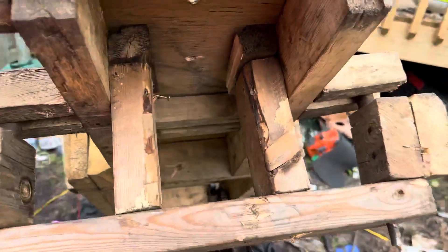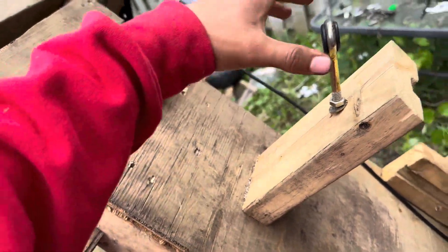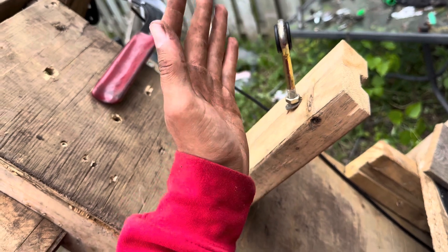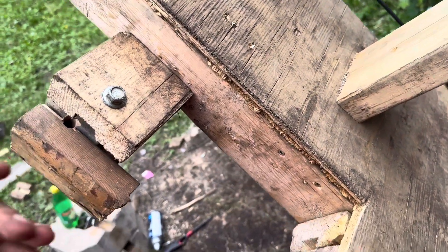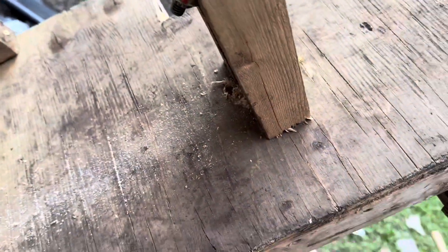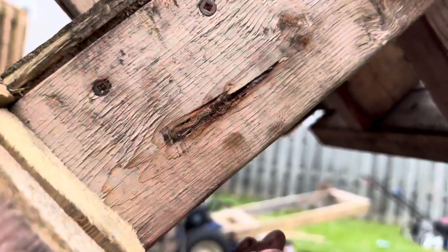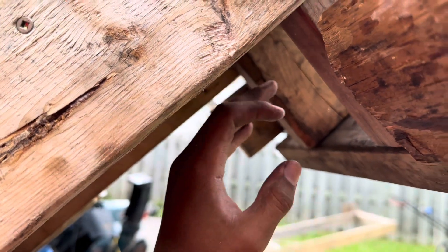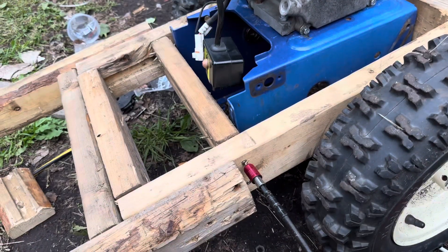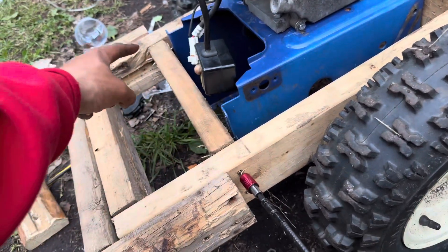It's already all put together now. This is where the hole is for the steering rod. I'll have to make its arm back here, remount this probably on a different angle, and put the push rods back. I gotta take this piece out that's holding this piece. I already started drilling the hole here — it's gotta go at an angle because I gotta remount my steering rod back here instead of in the front.